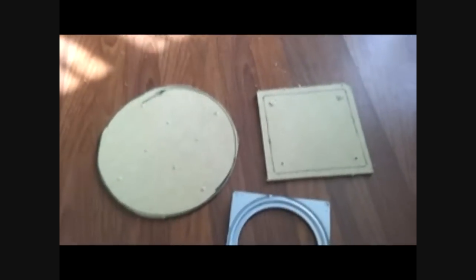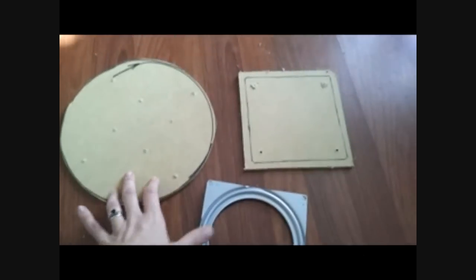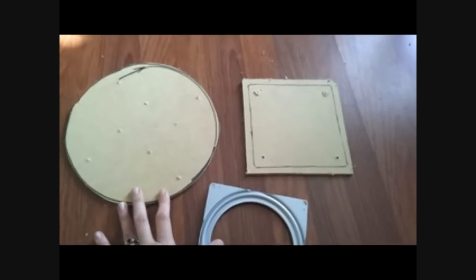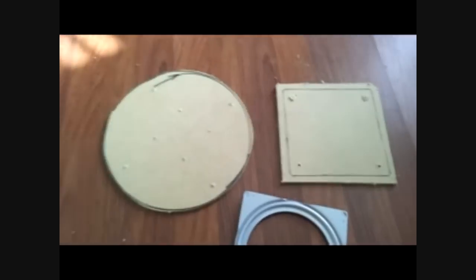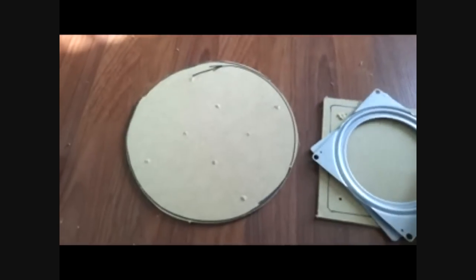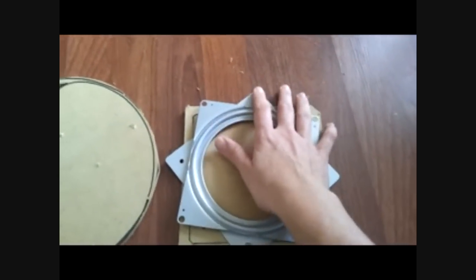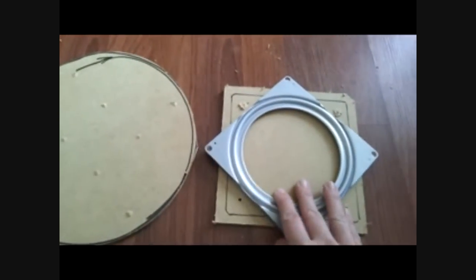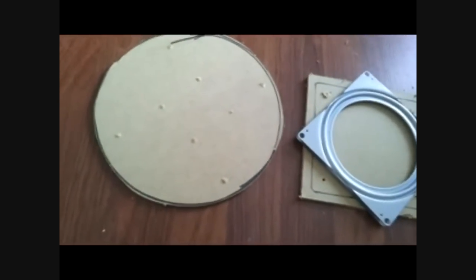Alright, so this is the assembly of the bottom part of the pole. As you can see, I have a circle particle board and a square. I saw a comment about why not have the bottom be entirely a circle so you don't tear up your feet. I tried to do that, but it didn't work because you have to be able to turn part of the Lazy Susan to the outside so you can screw it through to the other board — both circles overlapped each other. So I'm going to make the bottom a square and the top a circle so my feet don't get torn up.